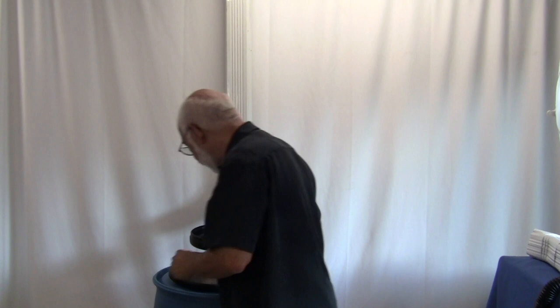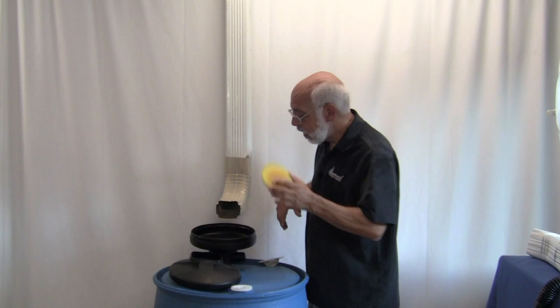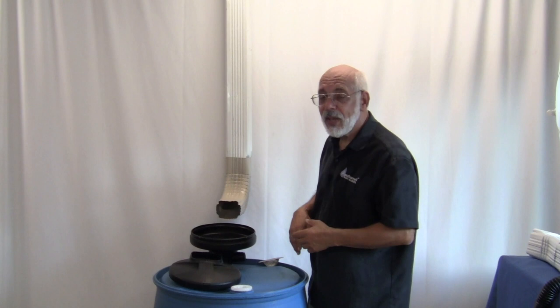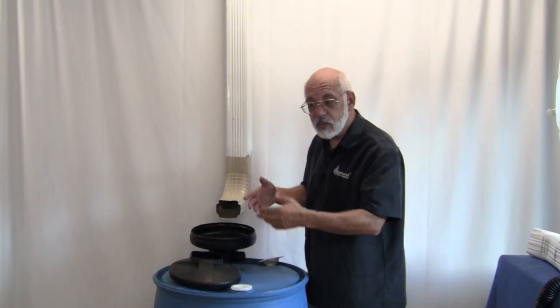There are two screens that come with this unit. There's a metal screen that's going to make the base of our unit, and there's a piece of foam padding. This is going to help reduce the volume of debris that's likely to get into your tank and mosquitoes that might be trying to get in and out. That filter media goes there. How often do you service it? Depends on how much junk you've got coming down your downspout, how new your roof might be — that will depend on how much debris we have in this unit. It's easy — just take it out and maintain it. We have extra foam pads available if this one starts to get nasty over time. That's one method of an open unit to bring water over.